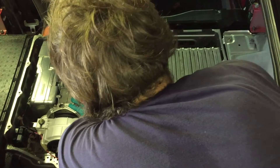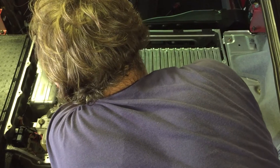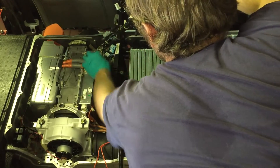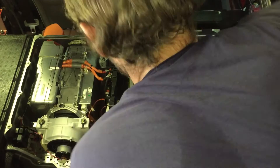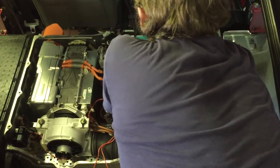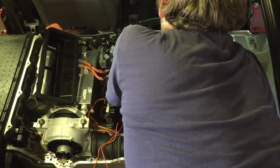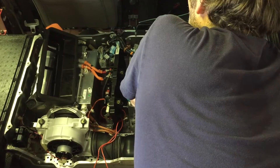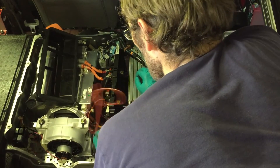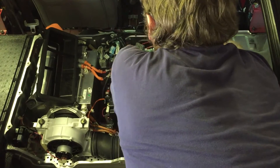If I pull the IMA battery harness out here, you can see how I have it routed — see how it goes through that hole. All these other cables, you'll want to put them in some kind of conduit so that they don't short out. They'll just route around. Here's our air dam — I'll remove it for now. There's plenty of space. This will route around; you'll hook it up to your negative right here. And then you'll have the two fuse and switch leads, which will also wrap around here — they'll also be in a shield and they'll be thick cables.